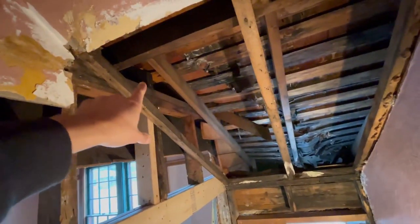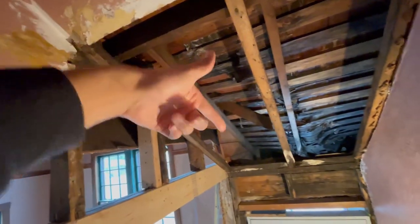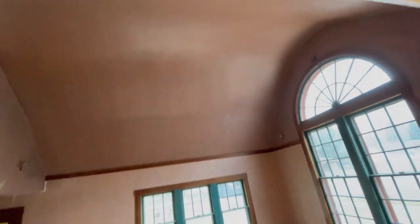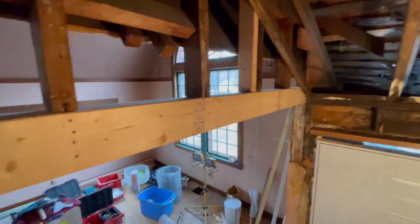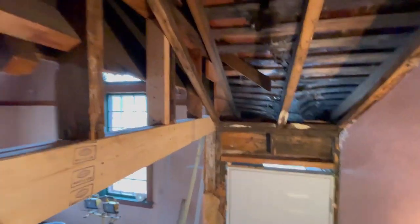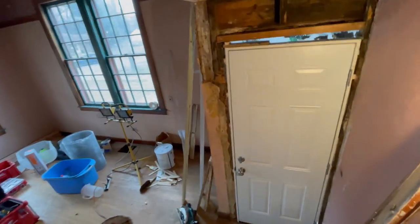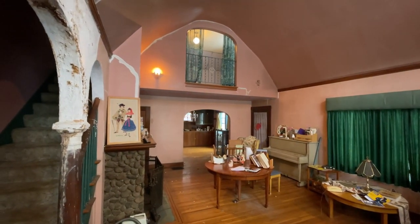Thankfully when this wall came down we didn't have to build a support wall. Typically you'd build a support wall so the ceiling doesn't drop when you take the beam off. With how this is, part of the load is actually supported by the other roof here coming down into the valley. This went in super well - super sturdy. Each of these two-by-sixes were ten dollars, plus some nails and a sister joist on that two-by-four, so it ended up costing less than fifty dollars total.